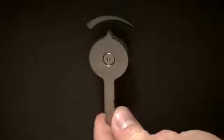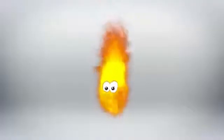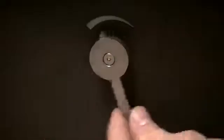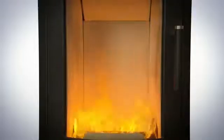It's best to try and observe for yourself how the fire reacts. If the flame tips are black or if the flames are blue, the fire does not get enough oxygen. Please note, a clean combustion is visible. It shows by a clean glass, a white firebox lining and the color of the flames.